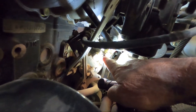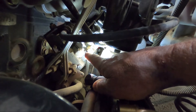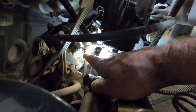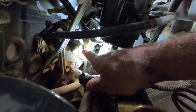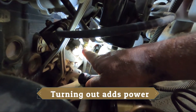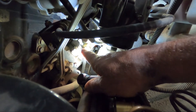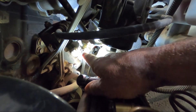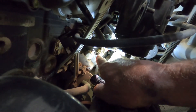This screw right here is the rack stop screw, and it adjusts how far the rack is allowed to open. The rack basically limits how much fuel is allowed to be metered out of the fuel injection pump per power setting — it's the maximum amount that can come out. If you start screwing this in you're going to get tons of power, but you've got to be careful because it has to match the airflow. Too much fuel and not enough airflow and you'll drop exhaust valves, seize the crown on your pistons. Once set on the dyno, they crimp a sleeve on here so you can't adjust it.